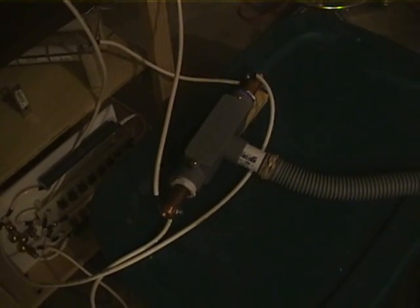We just rigged up a very quick hyperbaric gap - that is two copper pipe electrodes and a vacuum cleaner. That's a Black & Decker HandyVac, which we just had to buy because I just wrecked the motor on the other one. It's feeding the hyperbaric chamber on blow, not on suck. The chamber is a small PVC coupling with two copper electrodes coming from the sides. They were wrapped in Teflon tape, so they just screw right in and you can adjust the gap width just by turning them.